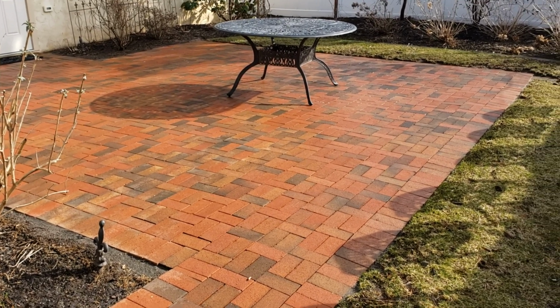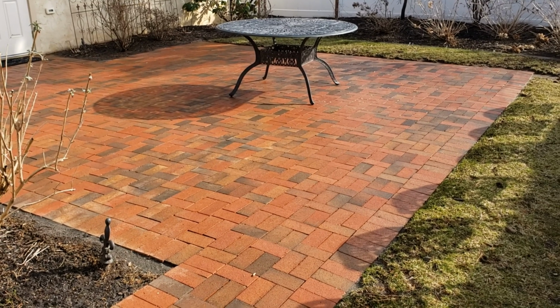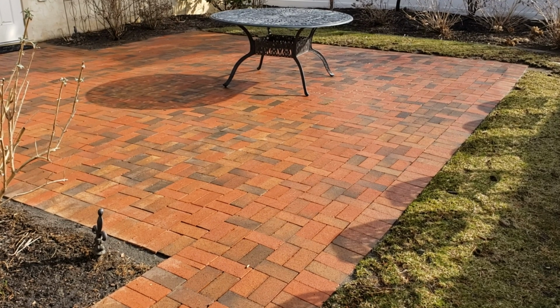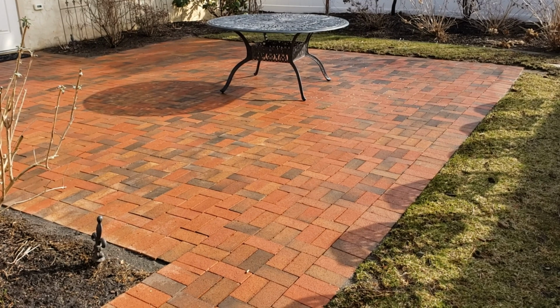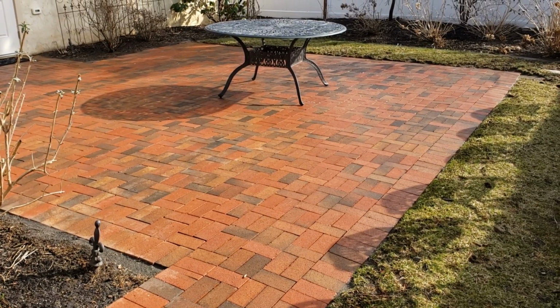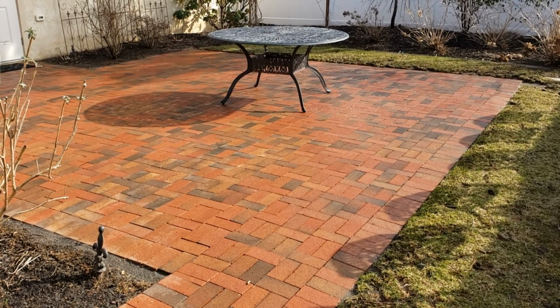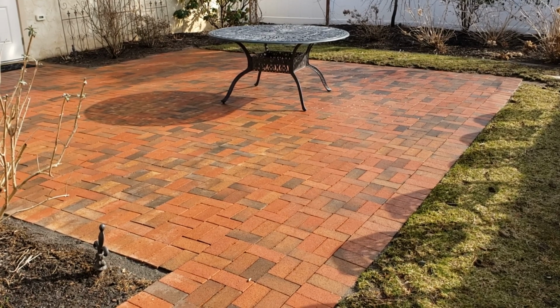And if you pressure wash it only, that typically comes back again within about 6 months. It usually looks choppy, almost like a camouflage type of a pattern, because when you pressure wash it, you don't evenly pressure wash it off the surface. So it comes back uneven. And when you treat it with a soap solution like we do, it kills the organism that grows on the surface, and that usually makes the average patio last 2 to 3 years, depending upon shading, obviously. The more shade you have, the quicker the organic growth is going to come back.